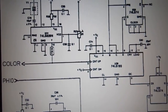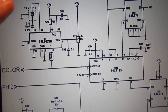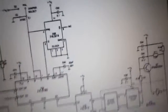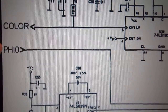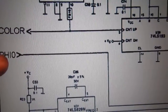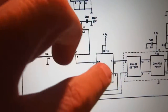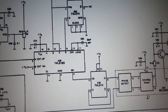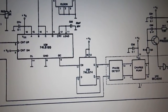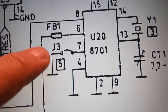This is a standard PLL circuit with a crystal oscillator, dividers, charge pump, filters, and so on. It requires the phi0, the main CPU clock, which is obtained from the VIC chip as a phase comparator signal. This is the first Commodore schematic for generating the two clocks needed by the Commodore 64.